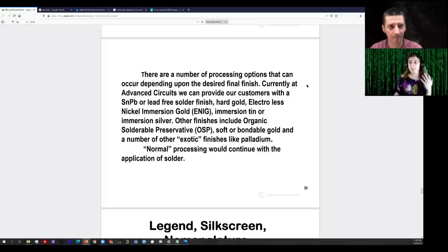There's also Organic Solderable Preservative (OSP) — a polymer matrix that gets deposited. It's cheap and certainly solderable, though it won't give quite the stability of ENIG, but it will still be very planar. There's also ENIPIG — Electroless Nickel, Electroless Palladium, Immersion Gold — which gives you a thicker layer used for wire bonding gold. When you wire bond gold you have to bond into a slightly softer metal. There are a lot of different types of surface finishes. Anytime you hear 'soft bondable gold,' that's probably electroless gold, which is a lot more expensive because of the greater amount of gold deposited.